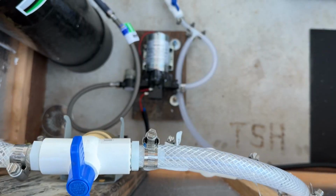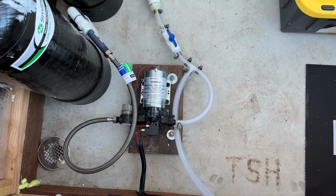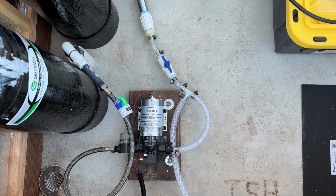Third was my panic the first time I started the pump, and it didn't seem to work the way that it should. He came out and said, "We have a problem. Pump isn't working." Well, it was on and making noise, but there was no water actually getting from the tank to the pump. I couldn't see it in the hoses anywhere. Our first thought was, oh crap, maybe that pump isn't strong enough to pull water because we dug that tank down and it has to come up 3 feet. Or maybe the pipe was too small. We were freaking out.